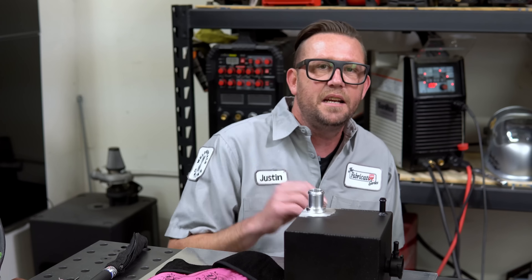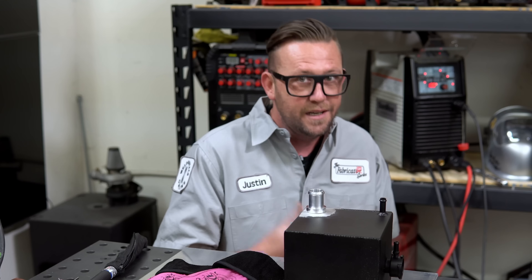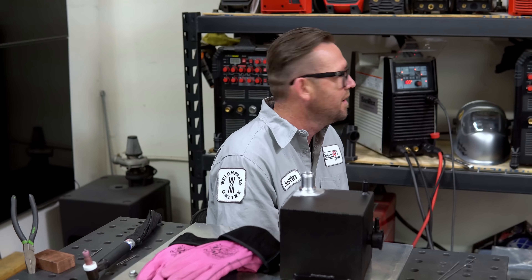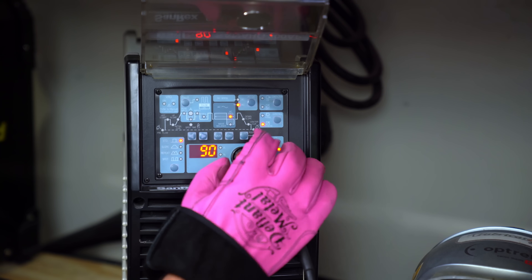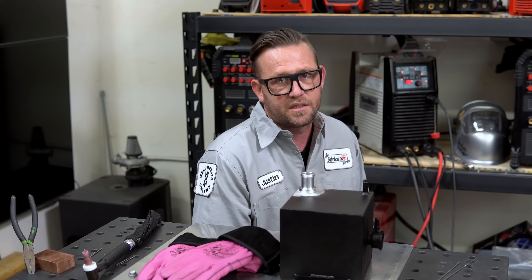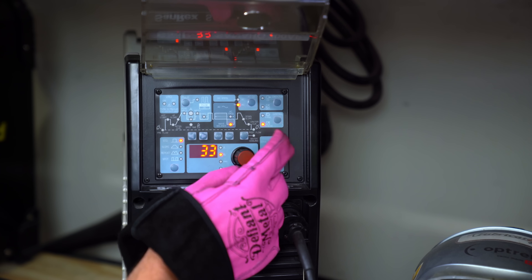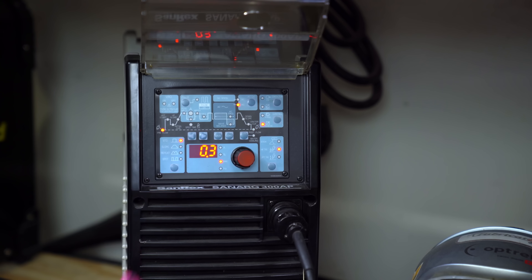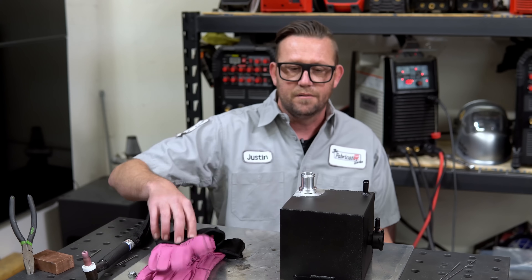I like to have that little extra kick in case I need it. So if I'm not getting what I think I need, I can give it a little blast to make it cooperate — that's why I dial it high. It probably doesn't need much more than about 100 amps. My frequency is set to 90 hertz — that's just my sweet spot. Since this is a positive reference machine, my balance is set to 33% positive. Both parts have already been pre-cleaned with some acetone, and I don't think I'll need a preheat — the tack weld will tell me.